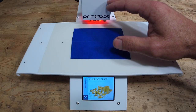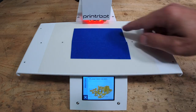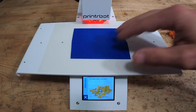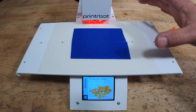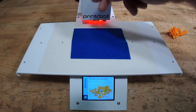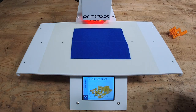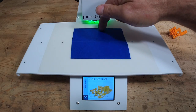This is gonna be a little warmer than normal because I printed just a minute ago before I switched out my clean tape. You can see the red LED says that I'm warming up. That's gonna warm up and when it's ready to go it'll change the LED color. It homed X and Y, and that's great, but if you have a little smudge of plastic on the end of your filament that's hard, you don't want to go down and hit your bed with that plastic. You want that sensor to get all the way down where it needs to go — that's why we warm it up first. So then the plastic's hot; if there happens to be a little bit on the bottom it'll probe at the correct point.